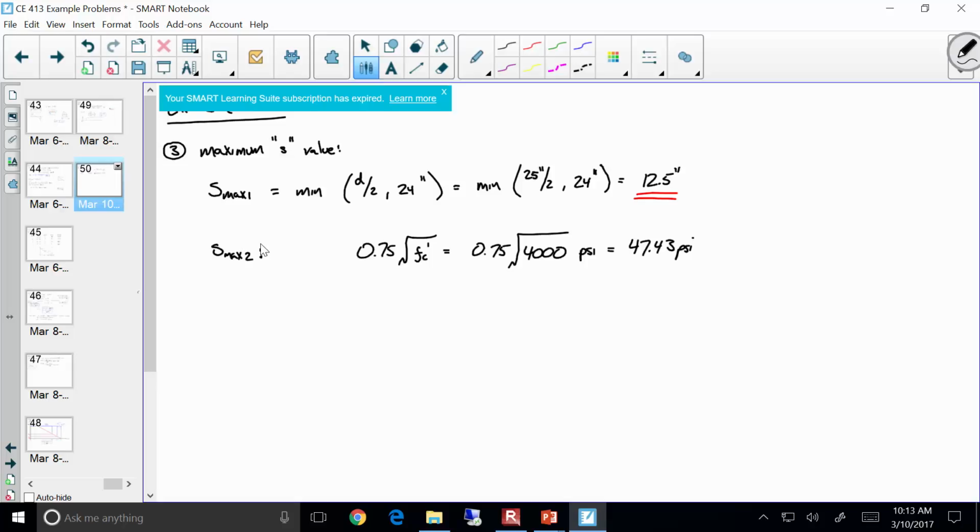All right, so what's the numerator of it's a big fraction. What's the numerator? AV times FY, or FYT. Okay, now the denominator, we have the width, the B, right, times the maximum of that, or 50. So what do we use? 50. Okay, but 50 what? PSI. Okay, that's important, and here's why.